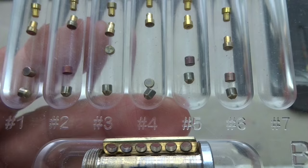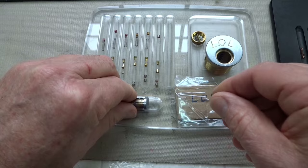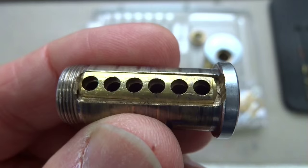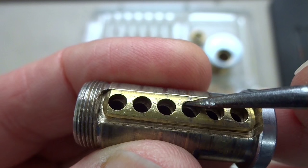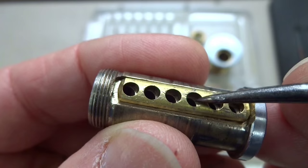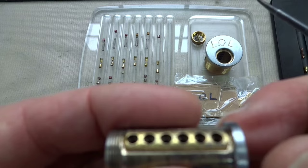I can't imagine the wafers would be on top of the drunken spool, so I put them the way I believe they go. When I dumped the springs I found six extra wafers. You might think: well, with all those wafers it's going to be really easy because that creates an extra shear line before you get to the complexity of those drunken spools. And if it weren't for the next little modification, you'd be a hundred percent right. Take a close look at the core — just amazing what he has done here. This is actually a little plate that comes out and it also kind of flops around in there. I'm sure that's by design, because if you pick to the false set, there's only one correct shear line. If you pick to the wrong shear line — or even the right shear line — this plate will move, leading you to believe you've actually picked that pin. It'll give you a false set, but then you've misaligned the holes. One correct shear line, just like in a Best lock, but it doesn't make it any easier to pick.